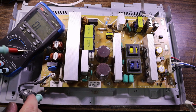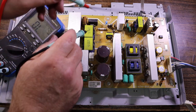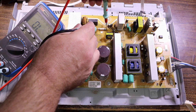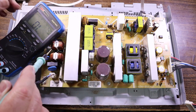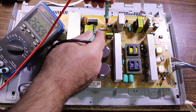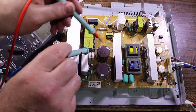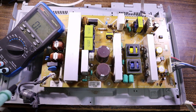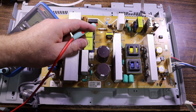Let's check the obvious — we have some fuses. There's another fuse over here. That's not good — we have one blown fuse. The resistance reads thousands of megaohms. And there's another fuse hiding down between these two caps — that one's okay.